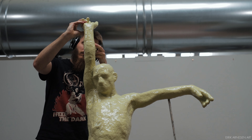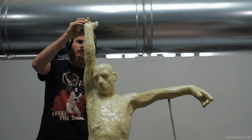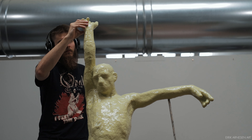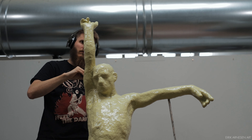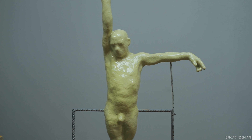We are ready for building walls in silicone. You'll hear me use 'seam' and 'silicone wall' interchangeably — that's because they're essentially the same thing. The silicone wall will be cut down the middle and the seam between the two halves of silicone will run where the cut was made. So with three layers the sculpture looks something like this.